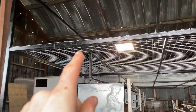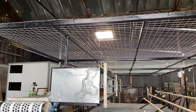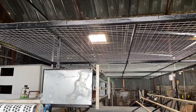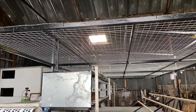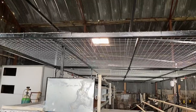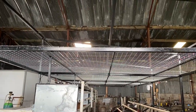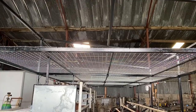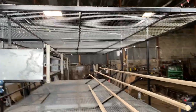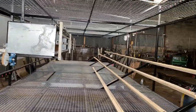I do need to put the MDF up there. I didn't bring the saw with me — I want to cut the sheets in half to make it easier to take them out and replace them. When the roof goes on, everything's going to have to go out the back door, so I'm going to cut the sheets in half. I didn't bring the saw, so I won't do that job today, but it needs to get done before the roof goes on. Next plan is clad this side, clad this side, then we can clad the two ends.